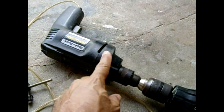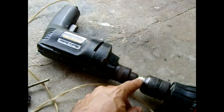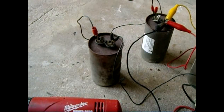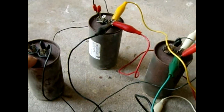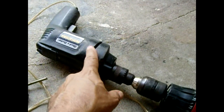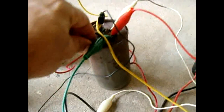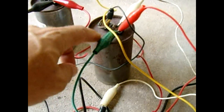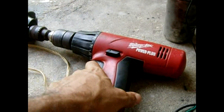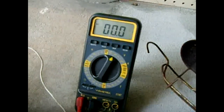You're going to have to experiment with the capacitance values for each motor you intend to use. A motor like this only requires maybe 20 or 30 microfarads, whereas a swimming pool pump that's one or one-and-a-half horsepower will probably require 200. You want to find the least amount of capacitance required to get the voltage to build within the AC motor you're using as a generator. Start with 100, spin the drill fast — or use a gas engine — and see if you get a voltage reading.